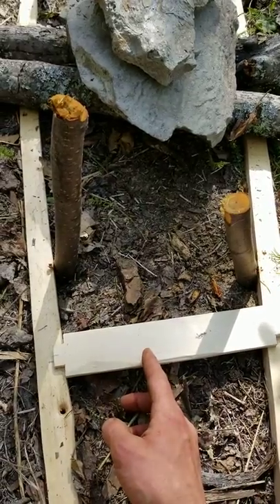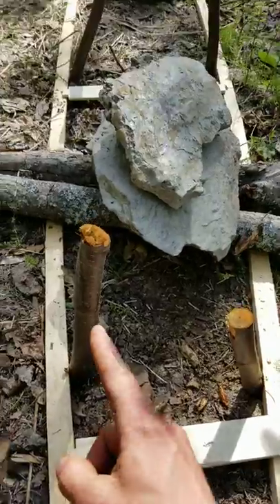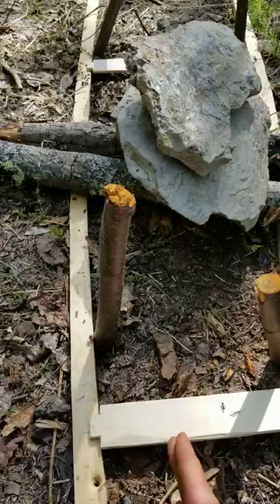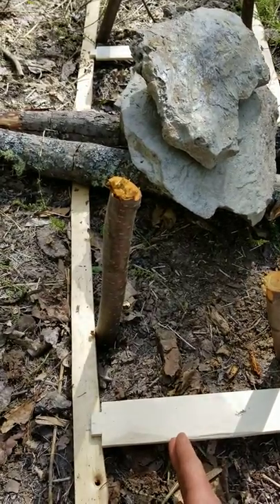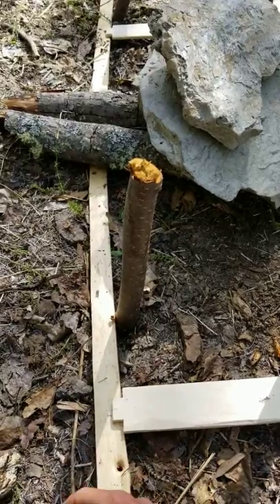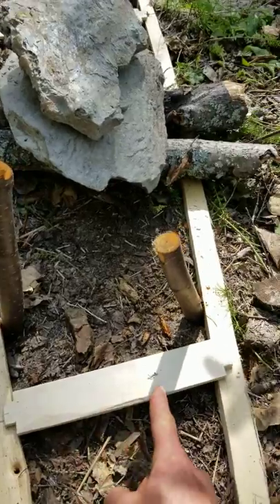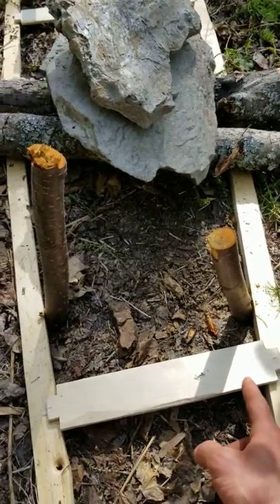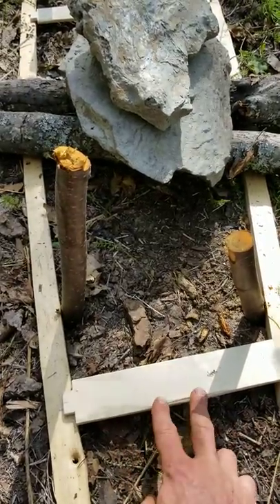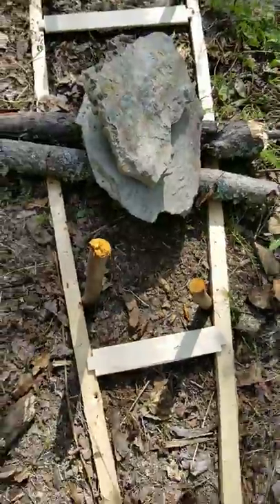There's going to be a step — a quarter inch on the inside of each frame piece to hold them out, because they're going to be tracing the shape of this curve. On the bearing surface on the inside of each frame member there's a step, and then it's going to be a pass-through mortise, not a blind mortise. It's going to do that on each side, so these will end up stepped in a quarter inch, and the center two will also have a step.